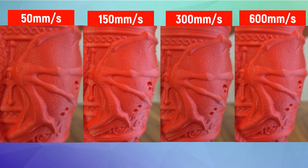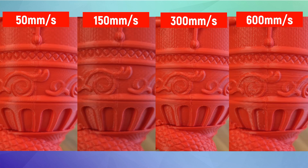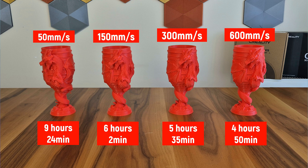Observing vibration is a bit more difficult in textured areas. Looking at the smooth spots on the dragon's wing, I can more easily observe how much the vibration effects increase — but all of these effects are at a very low level. The head part has many indentations, sharp points, and fine teeth, but there is no loss of detail in any of the four models. The patterns on the back of the chalice are very good up to 300 mm per second. At 600 mm per second, a few layer lines form in those patterns, but speeds below this are quite successful in terms of quality produced. Apart from these points, I think the differences are quite minimal.